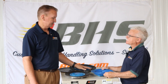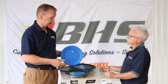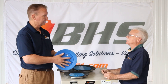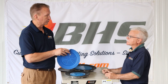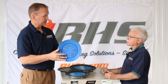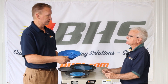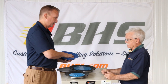My recommendation is always to go to the three-piece cup regardless. The typical damage to the cup is an operator attaches to the battery, then has to make an adjustment either horizontally or vertically — the cup edges get rolled over. We have also seen operators use the cup as a hook to hook a battery, and the cup gets torn. With the one-piece cup, if the rubber is torn, you can't replace it — you have to throw the whole cup away and buy a whole new cup.